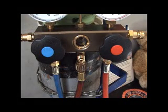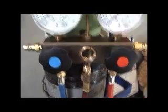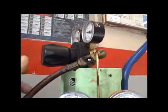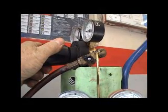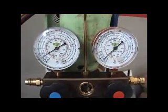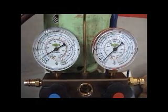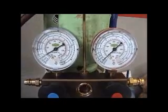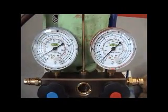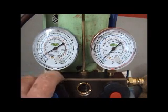Now personally, if we see over 2,000 psi on the left hand gauge, we set the regulator here to 10 bar on the right hand gauge. We connect the low and high side up if you can. The maximum pressure you should be putting in is 10 bar. You're over-pressurizing the low side by 5 times, but you're actually under-pressurizing the high side, so we can let it in very slowly from this side.